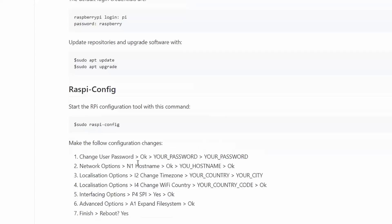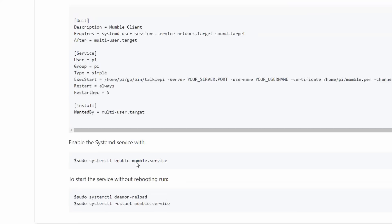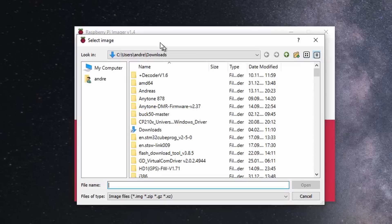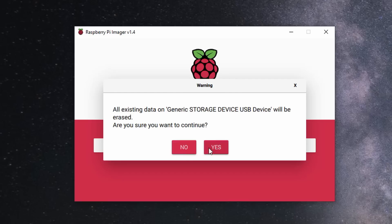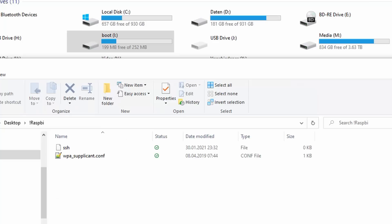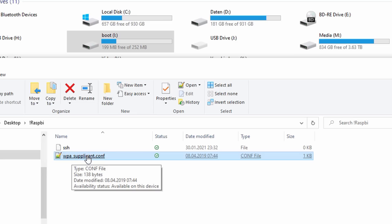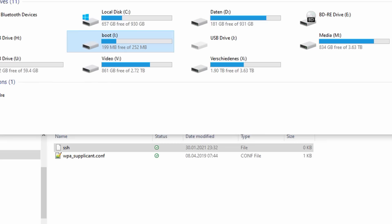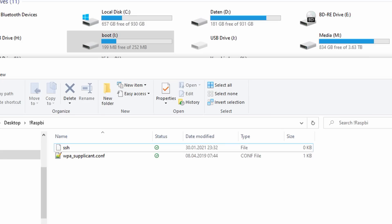Because it is not easy to install the needed software, I created a ready-made image of an SD card. You can download this file and store it on an SD card using Raspberry Pi Imager or another tool. It is around 8 GB and you should not have any problems if your card is bigger. If you want to install your device from scratch, you find the link in the description. Before inserting the SD card, you should add a WPA supplicant file and change your Wi-Fi credentials. I keep these two files on my PC's desktop and copy them to all SD cards I create for my Pi projects, so I always have a working Wi-Fi and SSH connection.